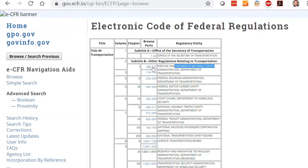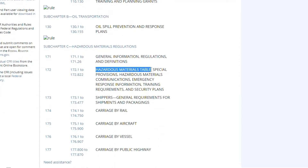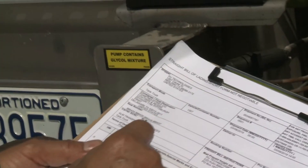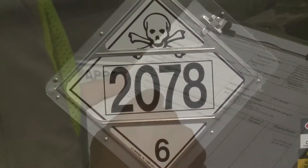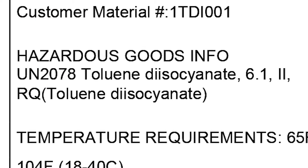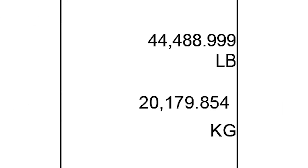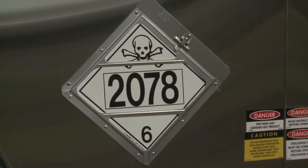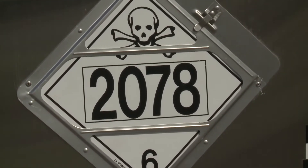In the U.S., the Department of Transportation (DOT) regulates the transportation of toluene diisocyanate. Although there are various regulations covering the shipment of TDI, it will typically be classified UN-2078, toluene diisocyanate, class 6.1, packing group 2, toxic substance. The letters RQ are entered either before or after the description of the shipment when individual packages contain 100 pounds or more of TDI. The toxic placard, with the UN marking 2078 displayed, is the normal placard for shipments of this material.